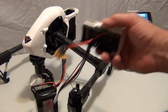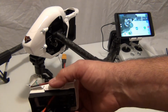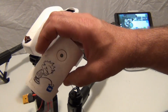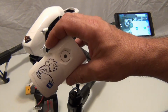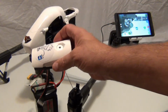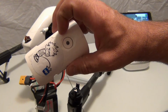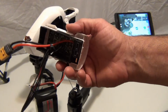The readings from the battery will be correct, so you're not flying around. Because when I put this battery in here and we check the data, it's going to say there's a battery error because the battery is 98%. And the app's probably going to show 63%, like the batteries light up here. But if you drain it all the way to 3%, take the props off, let everything sit on until that drone shuts itself off, it'll recalibrate, all 4 lights will be on, it'll be at 100%, the lipo will be at 100%. It's just the way it works for some reason. Someone said on a Phantom 2 or a Mavic Pro, they could hold the button for 20 seconds, it would reset the board. I'm not sure if that's correct with the Inspire 1's TB47 board.